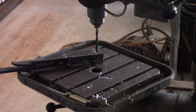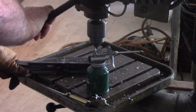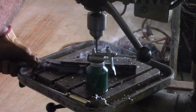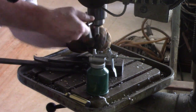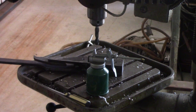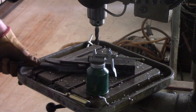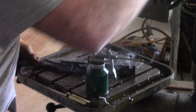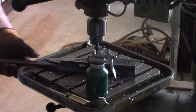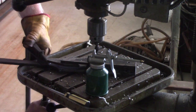I'm going to drill through with a smaller drill first, and now I've got to put a half-inch drill through. This one's got a lot more potential to grab, so I'll get that centered and put a clamp on it just to make sure it doesn't swing too much on me.